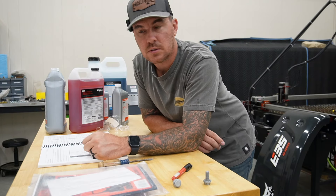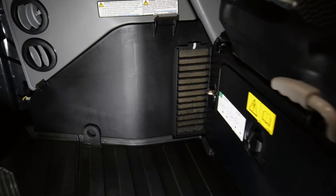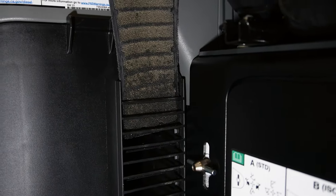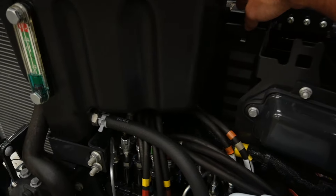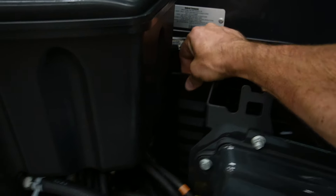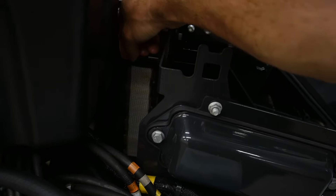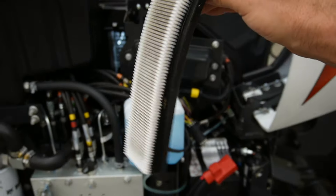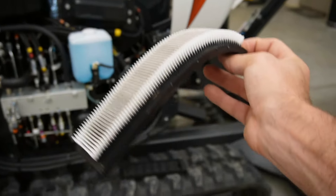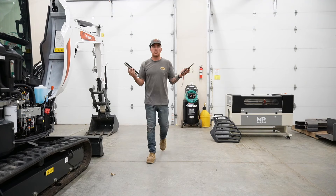Now I want to clean out the cabin filters — this is actually pretty easy on this machine. The cabin filter inside the cab is right there — that's about as easy as it gets. It comes out straight through there on the back side by all the hydraulics. Right here is the other side — the outer side of the filtration — you just grab the upper lip and pull toward it and it pops out. I'm going to blow both out with the air hose, wipe everything down, and put them back. This actually looks kind of dirty — oh my, this thing's filthy. That could have been in my lungs.